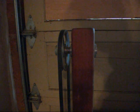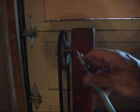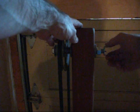If I want to spin something thinner with a smaller diameter — like a baseball bat — I use another five-eighths inch bolt that fits snugly in the pipe. There's a nail put into a hole drilled in the end for centering. I put the bolt through, tighten down a nut on one end, then put on a piece of sheet metal bent into a U-shape. I cut two notches in the wood, the nail centers it, and then grab it again with another jam nut. That lets me spin smaller, longer diameters where I don't have a lot of material on the back to grab, like in a bowl.